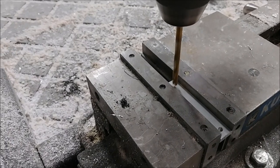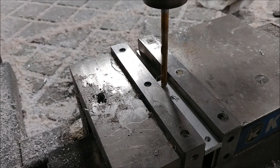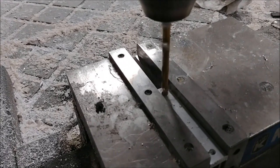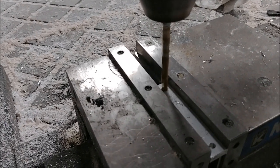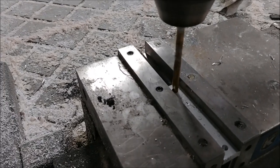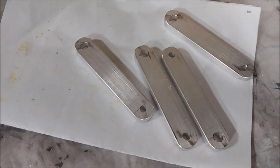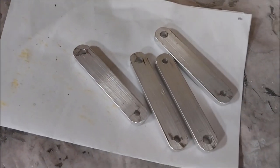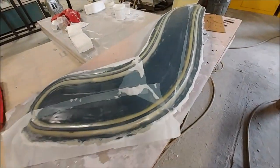Still working on stuff for the rudder pedals — these are brackets for the linkages for the brake actuators, the brake cylinders that link the pedals to the cylinders. Just drilling those on the big machine and then hand-working them after that to clean up the ends. It's nice having the machine — I tried doing a couple of smaller ones by hand with the drill press but I just can't get them as accurate. These ones came out nicely; I've rounded off all the corners and smoothed them out, so they're ready to go together when everything else is ready for the rudder pedals.